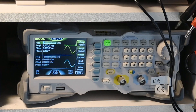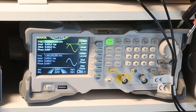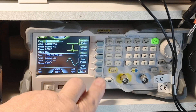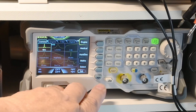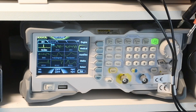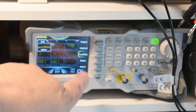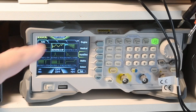One thing I find really cool about the arbitrary waveform generator is that beyond standard sine, square, and triangle waves, you can select from about 50 built-in arbitrary waveforms. For example, there's a sync pulse, a TV signal, and even medical waveforms — like a cardiac waveform. You could design a heart rate monitor, hook it up to this, and output a realistic cardiac heartbeat. There's also an ignition waveform, and several ISO waveforms representing different types of transients. When I designed my transient surge suppressors, I tested them with these.